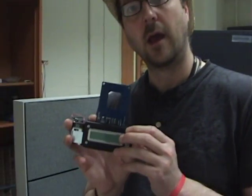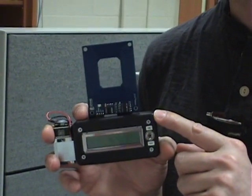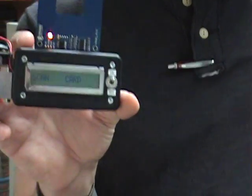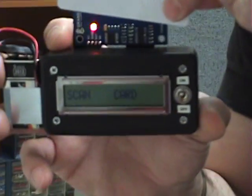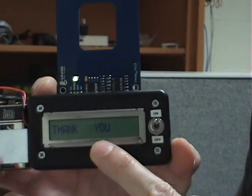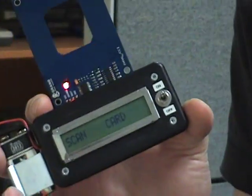What we use is this little guy right here — integrated with a little LCD, a 9-volt battery, and a controller, which is the PIC 18F452 on the inside. Originally this was breadboarded, but Jason built this little thing with the LCD. Here is a demonstration of what this does — it's simply an RFID tag scanner, just a reader. We have our tag from Parallax as well. The ID on this one is 0F02D741A4. If I wave it in front of my little device, the light turns green and we get on the LCD an indication of the number on this card, and a little message says thank you. It's a very polite little device. This is where we started.